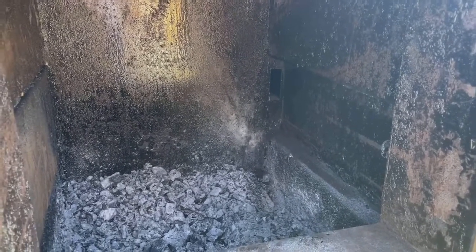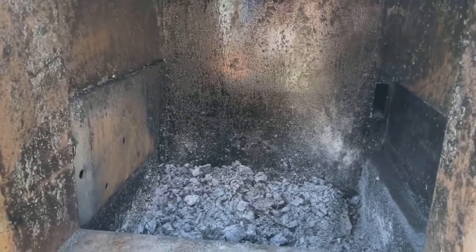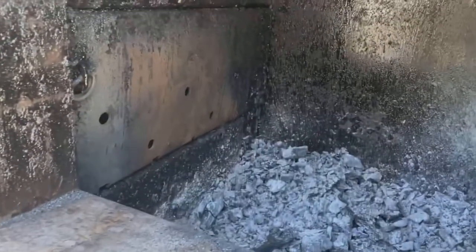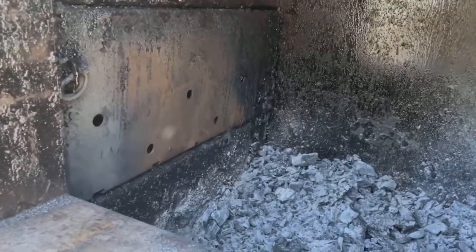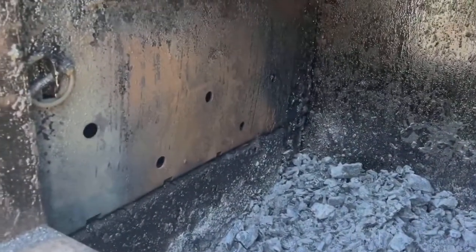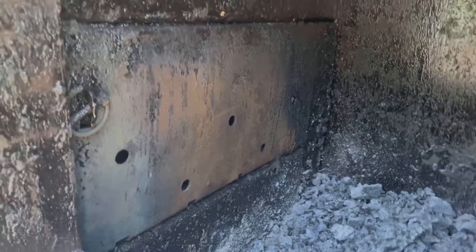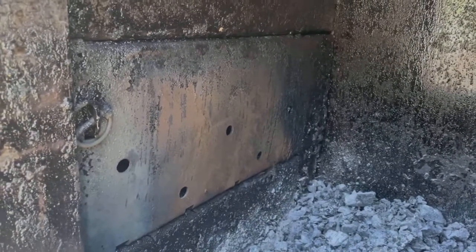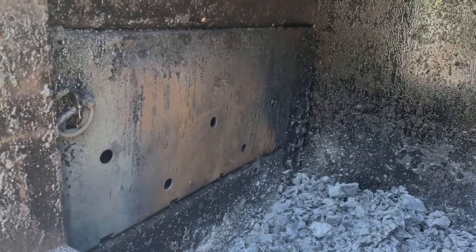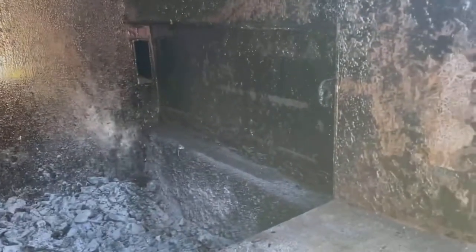And how long it actually takes is wholly dependent on whether or not you are doing your job during the burn season. I can tell you from experience that if you let the ash cover the bottom holes, them side panels will start to fill up with creosote. If you let the ash really build up, I've seen it almost plug the top row of holes too. That's going to take considerably longer to get clean. So again, how well you do your job while you're using it is going to affect how long it takes you to clean it when you're done with it.